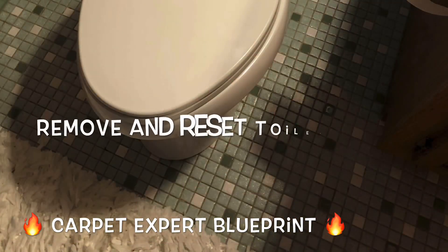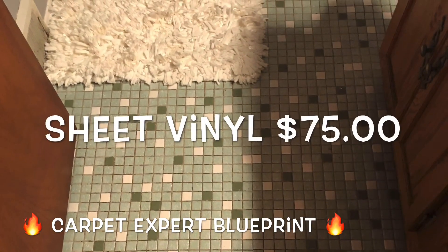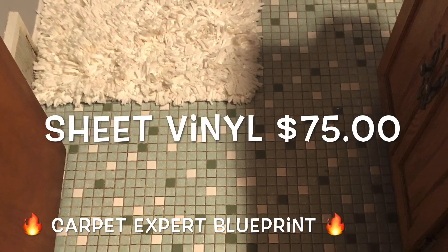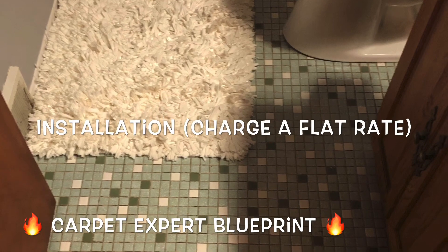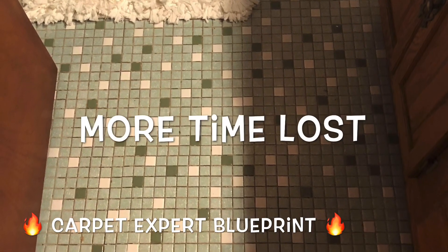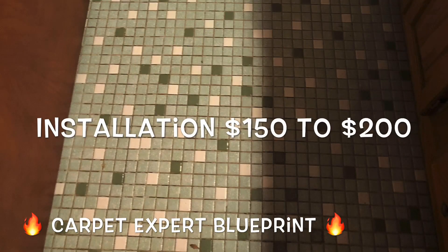Prior to that you've got to pull the toilet and reset it and buy a wax ring — that's at least $75. So you pull the toilet, skim the floors, wait for it to dry. Even a tiny room like this, the piece of sheet vinyl is going to cost you about $75. Then you install the sheet vinyl — that's the easy part, in and out — but then you've got to take your time trimming it in. This bathroom has tile baseboards we're not swapping out, so you have to caulk the whole perimeter and make sure it's cut perfectly. There's no room for error because you can't hang a new baseboard or do any quarter-round trim. So you have to figure for all that downtime.